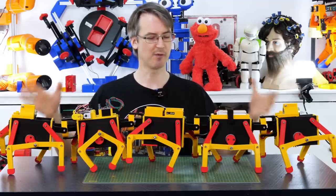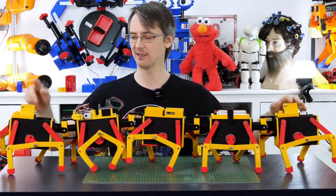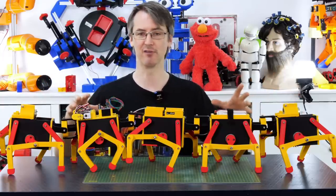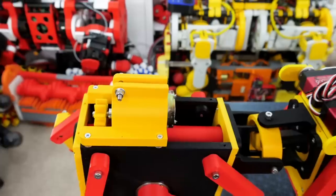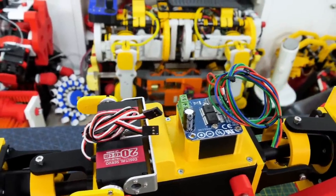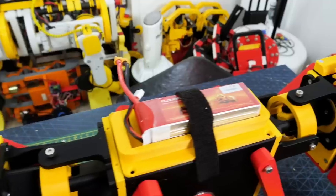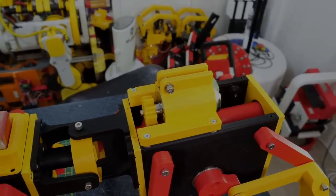It works okay with three modules but we've got five in total, so I've put a motor at both ends. They're still mechanically linked all the way through with those universal joints, but now we've got two motors driving it because of all the extra friction of the two extra modules. I've also got three extra things on top of the middle modules: a head motor, two servos for steering, a motor driver, an Arduino Mega, and a 3S LiPo battery for the motors. Here's our tail motor, making up all five segments.